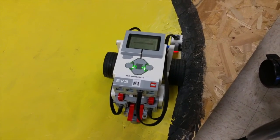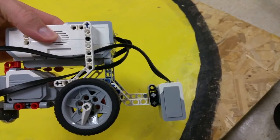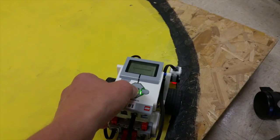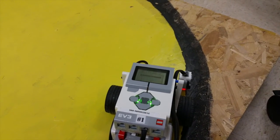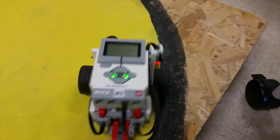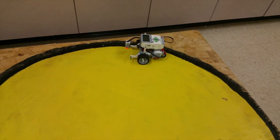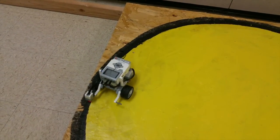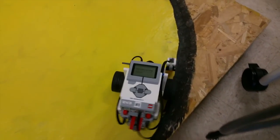I've downloaded my program and we're going to try to get it to follow this circle all the way around. I put my light sensor back so it's pointing down to detect the reflected light. If it sees the line, it goes forward and to the left; if it doesn't see the line, it goes to the right to look for it again. You can see it's basically just moving around, constantly going left to right, left to right, looking for the line — and when it finds it, it goes forward and to the left, keeping it going all the way around.